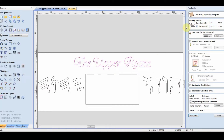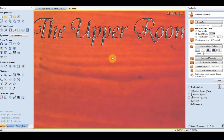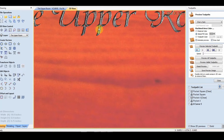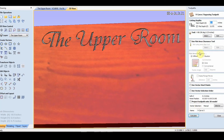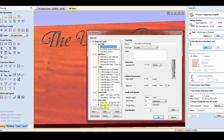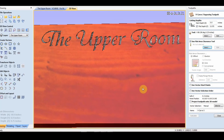By default, this flat depth is checked, and start depth is zero. What can happen — let me reset the preview and run that toolpath simulation — is usually you get an outline, but the middle of the letters is still there. What people will often do to try to offset that is to use a flat area clearance tool, but that won't let you use vBits. It only allows ball nose, end mill, and some engraving bits, and that can produce undesirable results and can tear up your material sometimes.